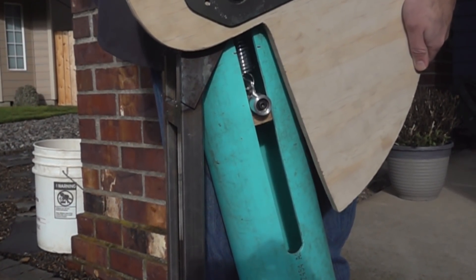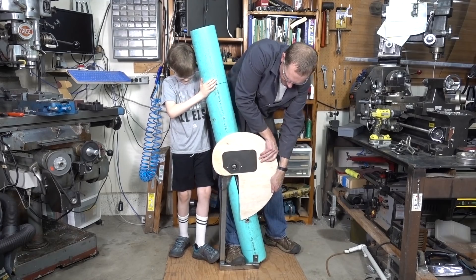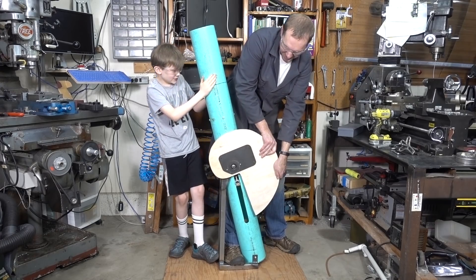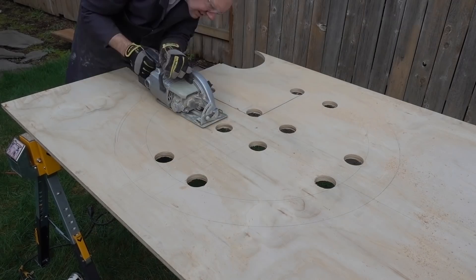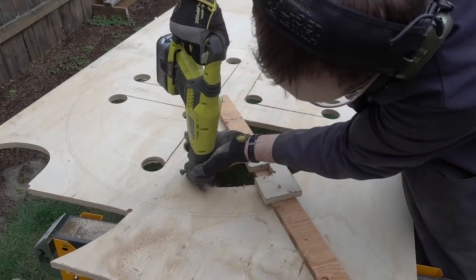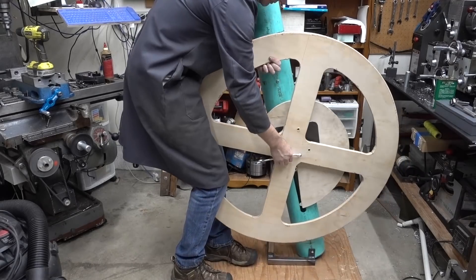Though it's not exactly launching high enough to paint a gymnasium ceiling with eggs, that's probably best if we ever want to get invited back to the school. But wait — this doesn't exactly look safe for kids. If a finger gets caught by the plunger, it's going to mean a trip to the emergency room. Don't worry, I've literally got it covered. If we drive the cam with a giant wheel, then a whole team of kids could push on it at once without injury. I just need a giant sheet of plywood and a way to cut a circle out of it. So after clearing out some spokes, I'm mounting my sawzall to a board, pivoting around the center point and working my way around the circumference until it's done. Then after adding some threaded bosses to the plate, it's ready to mount to the cannon.